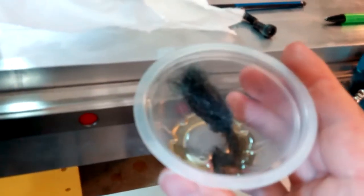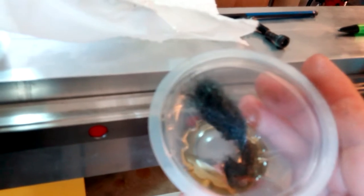We want to make sure those grooves are nice and clean before we put our new bearings on. I recommend some fine steel wool and some engine oil or olive oil. Preferably not WD-40 unless you're going to wipe it all down, because the WD-40 will take the grease from the new bearing along with it. So try and use oil. If you use WD-40, make sure you wipe it nice and clean after you're done.